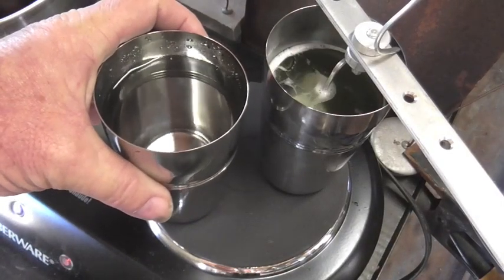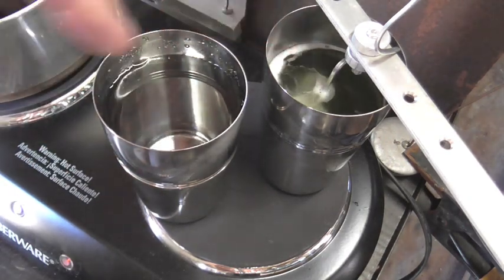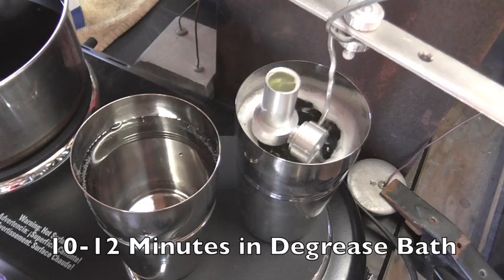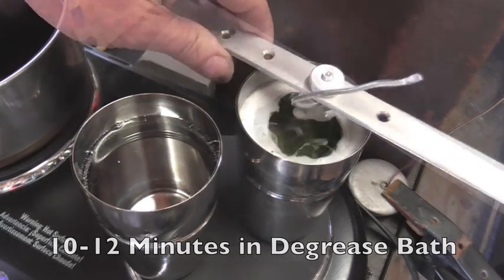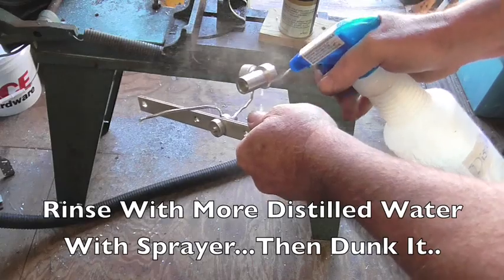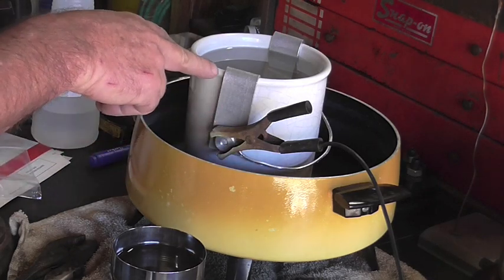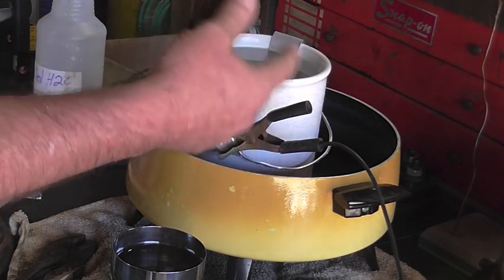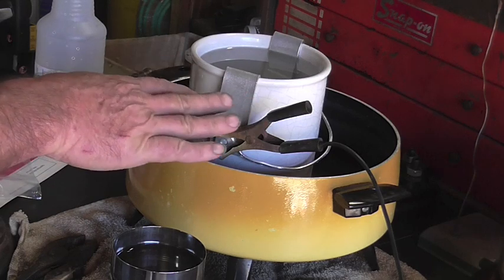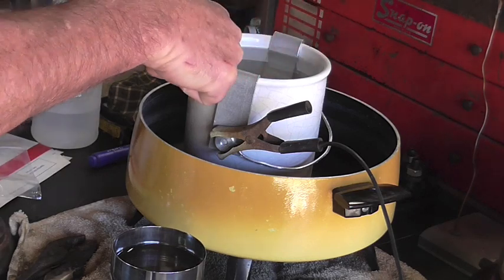While that's cooking away, this is another container of just distilled water to rinse that part after we pull it out. Just to make sure I wasn't trapping any air during the anodizing process, I went ahead and flipped the part to where it's sitting vertical. Regular tap water has chemicals and minerals in it, so distilled water is important. Over here I set the container of battery acid in a larger container — I'll explain what it's for if necessary. I've got the negative hooked up to the cathode, which is connected to the other one via wire.